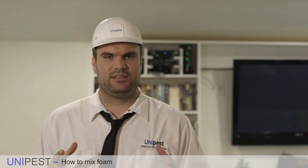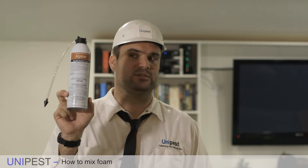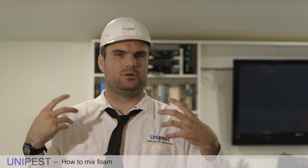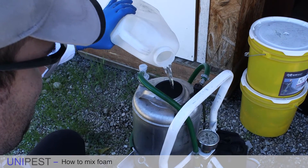You're first going to take the foaming machine — in this case the foaming machine is already empty — and decide how much foam you're going to need. You don't want to mix too much foam and just have it sitting in the foamer. So ideally, if you have large jobs where a small amount of foam just isn't enough, it's good to show up with a machine and mix your own foam on site. You take the empty foamer and first fill it with the proper amount of water.